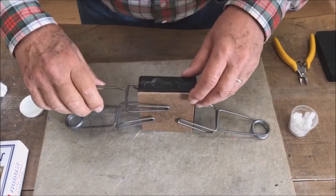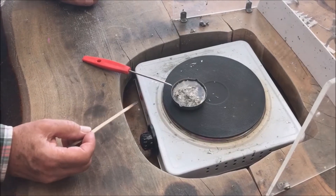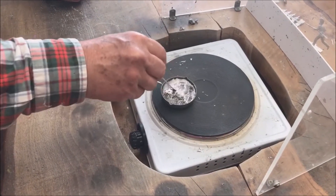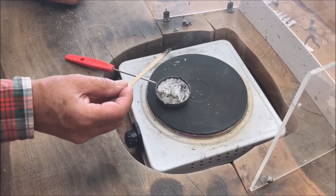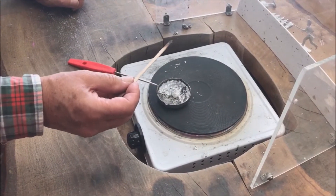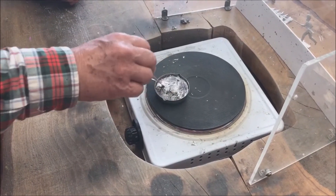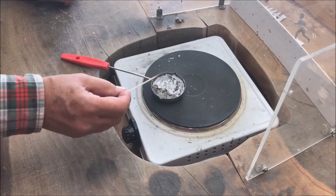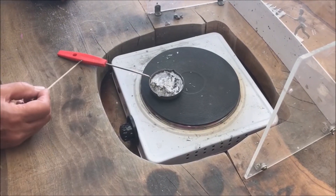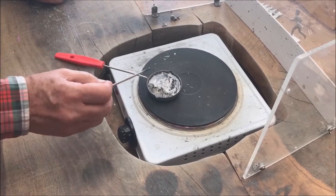The function of the clamp is to hold the mould together and it is also flexible enough to allow air to escape. To cast the cannon we recommend high quality metal and we supply model metal. Use our wooden metal stirrer stick or the end of a long match to test the temperature of the metal. If light smoke arises after putting it in the metal for 5-10 seconds then the metal is ready to cast. If there is no smoke the metal is still not hot enough. Most domestic cookers will heat the metal to 300 or 320 Celsius but you need to leave the metal on for at least 5-10 minutes before casting.